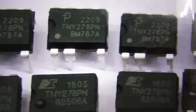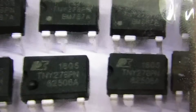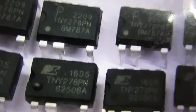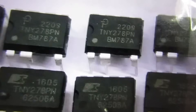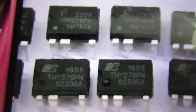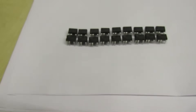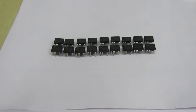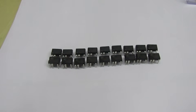If you look at the pin one ident on the genuine one, it's painted on, whereas on the fake one it's actually molded into the plastic of the chip. So there we go — that's my little tip of the day: don't buy one, buy ten. When you find out they're fakes, all you do is send them back. Many thanks for watching and I'll catch you in the next one. Goodbye!